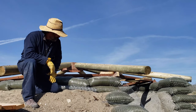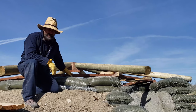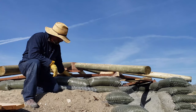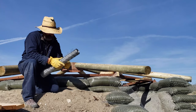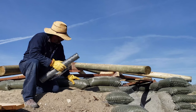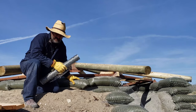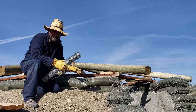Last night I came out and used the laser level and shimmed the sill plate to make sure it's all flat and level. This morning I'm going to put on this layer of wire over the outer edge of the bags, stitch it all together, and get ready for putting stucco and cement in here to hold everything in place.